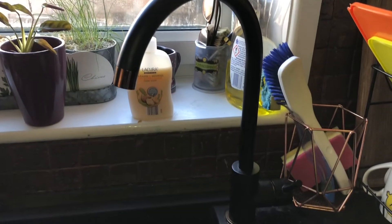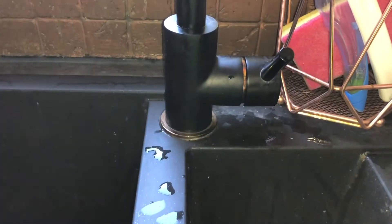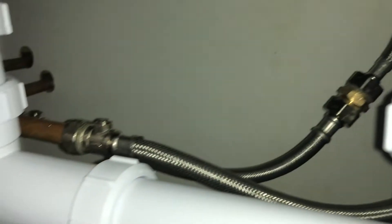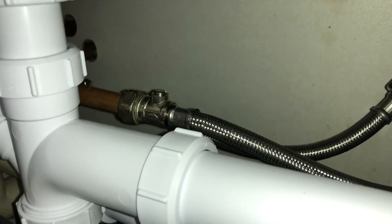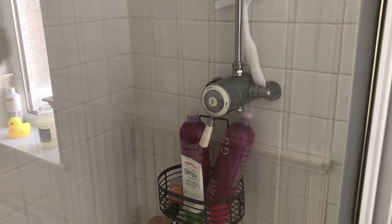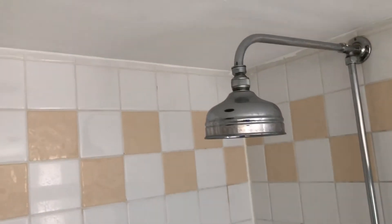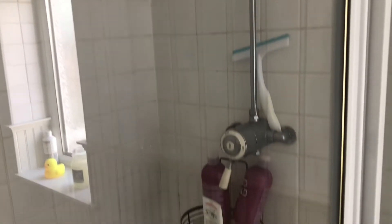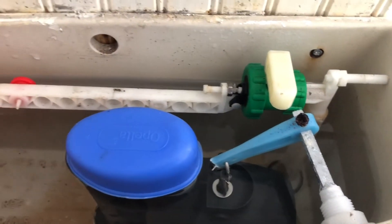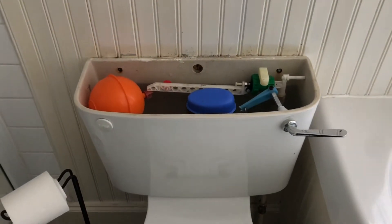What it's doing is preventing the whole house from having problems. Your kitchen tap can start making strange noises, start dribbling, or even turn on by itself when the pressure gets too high. Under the sink, modern plumbing reuses a lot of flexible hoses — these can split. With your shower, you can start leaking from the middle, it can mysteriously turn on in the night for a brief couple of seconds, and start dripping.